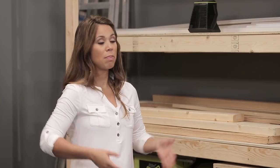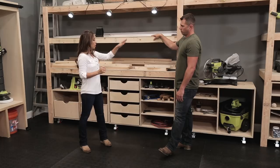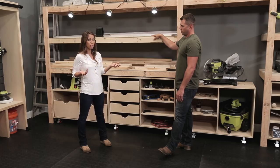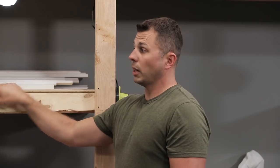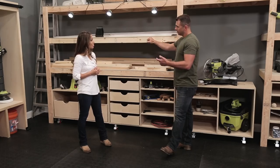We wanted to make something very simple that you can build with just a few tools. Maybe have your Home Depot rip your plywood in half, so all the shelving is just plywood ripped in half to 24 inches wide — zero waste. It's all framed with just simple off-the-shelf 2x4s and some screws. Very simple, very economical, a very easy way to get your shop cleaned up so you can really start to have some fun in it. And I love that it's 2x4s — easy to work with and durable.